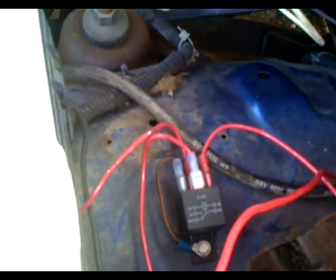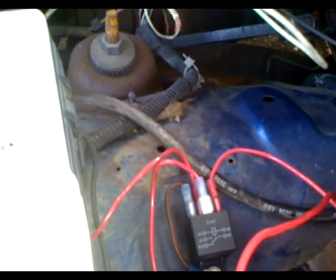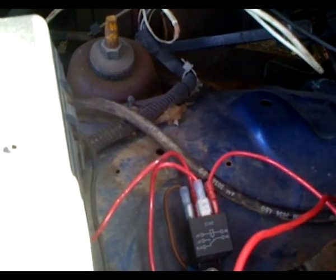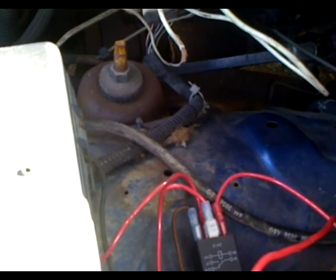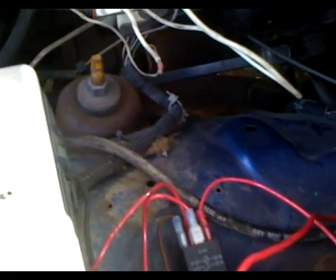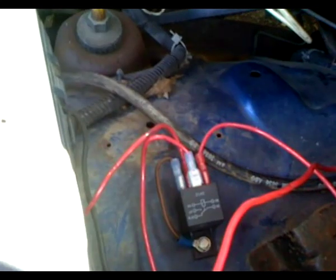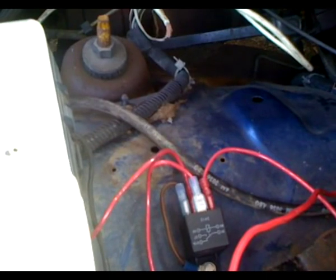When I turn the truck on, it starts and runs fine. The voltage is down — I'm pulling about 14.4, shoots about 14.5 volts. I'm pretty happy and it's stable. Make sure you take the time to put in the proper connections, make sure everything is tight with no shorts, and you shouldn't have any trouble. $40 and a little bit of my time versus up to $1,500 for a PCM — that saves money. The only thing you have to put up with is the check engine light. I'm working on a theory for that and I'll make a schematic and test it.